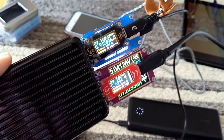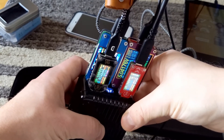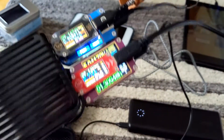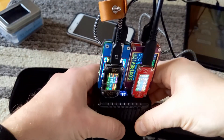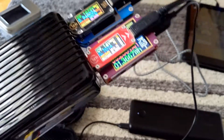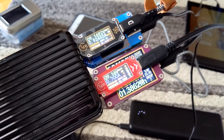Is there anything else I want to test? Trickle charge shouldn't affect this. We're at 95%. I'm going to double tap the button on the top. Now it's got that trickle charge logo. That really just keeps the battery on, especially if there's a low current being pulled — like from a watch or a Bluetooth device that doesn't suck a whole lot of amperage. The efficiency charging it slow is really good. It took about a day to charge the super tank at 5 volts and 1 amp — obviously really slow.